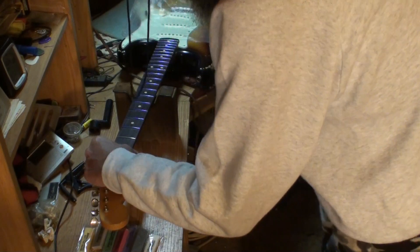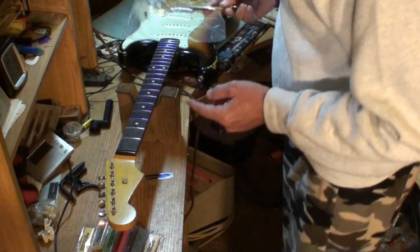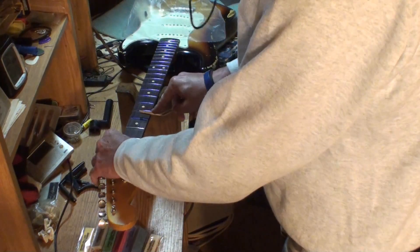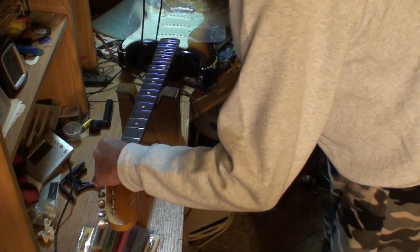You probably can't see it very well — let me adjust so you can see a little better. By the time I do this — these files are fast man, super fast, they're diamond grit. I hope those erasers are pretty quick too for this job. There's no need on this guitar to level all the frets with no more wear than that. I'm going to take what wear is left after the radius block and get the rest of it with these crown files. Amazing how fast these files are.